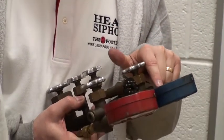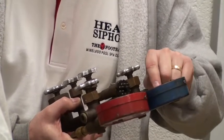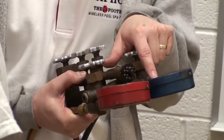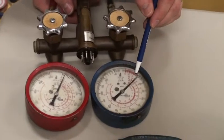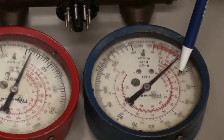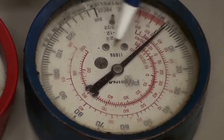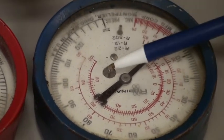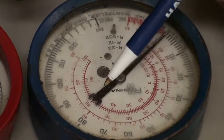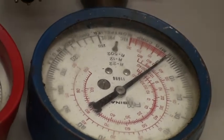They don't have the color scale, but it looks like the 3 scales are going to use the inner one. See those three sets of numbers — the R-22 temperature, you can see where it's 65. The numbers here are 502, the numbers here are 12, and the inner ring of numbers is R-22. So if you hook this up to our unit and it's equalizing at 110, it should be somewhere around 60 — 60, 65.